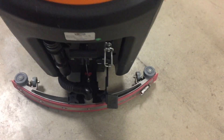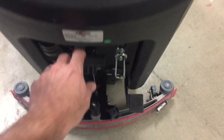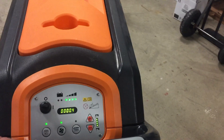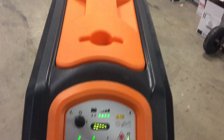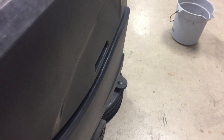This thing's turned on back here. We're going to let the squeegee down, and we're also going to let the front deck down. So that lets the front deck down, and this lets the squeegee down. Then I just hit this button here, and that's going to turn on the back. Once I hit this little activate button, it's going to activate the machine. It's going to take a second for that water to get rolling, but once it gets rolling, it's going to be coming out.